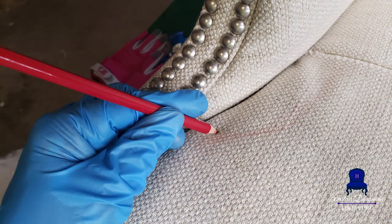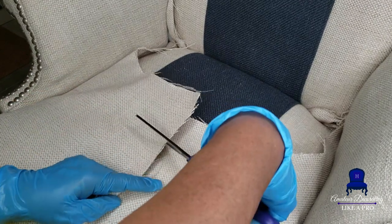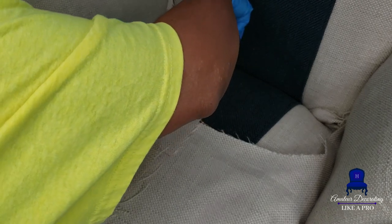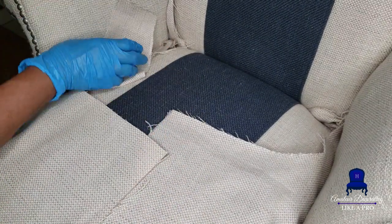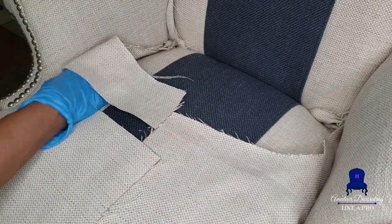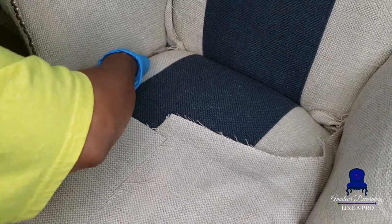I really encourage you to go back and watch the original video because I am speeding this up a little since I've covered these chairs before. I am cutting away just a horizontal line because I know there's a board there right at the point of those scissors, and I know there's one in the corner, so I've got this piece I can pull through into that opening underneath the armrest and pull it tight. That mark around the front, lower part is going to have to be cut in little bitty pieces and tucked underneath itself around that corner. I did not want to remove the armrest because that was a lot of work before, and I certainly didn't want to reinvent the wheel since I'm going to be using the same fabric anyway.